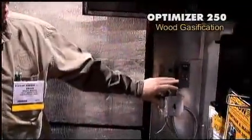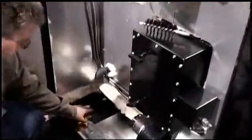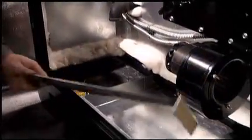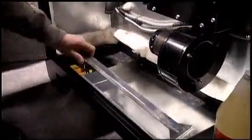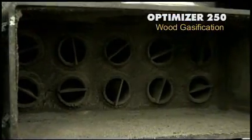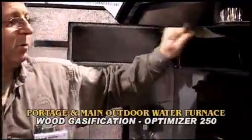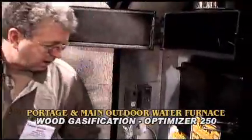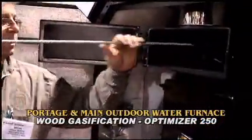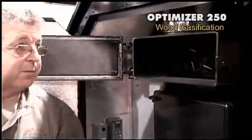We have two pump hookups — hot water coming out of the top on both sides and return water in the bottom, with knockouts in the bottom to run hoses through. It comes with a cleaning tool for scraping ashes out of the front and a little ash pan, plus a heavy-duty cleaning brush for the tubes. To clean, you pull out the stainless steel turbulators, run the brush through — it's open on the other end so debris drops down into the fire. It's a simple couple-minute job.